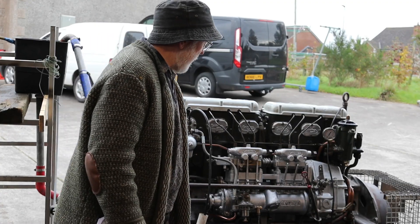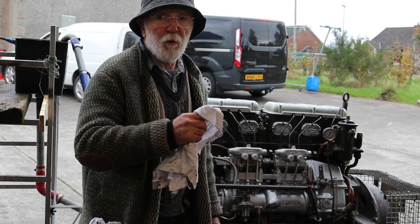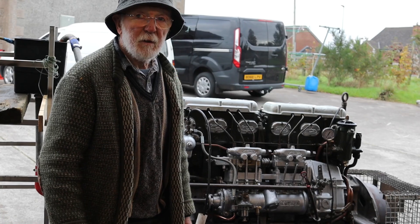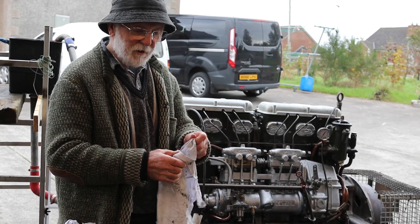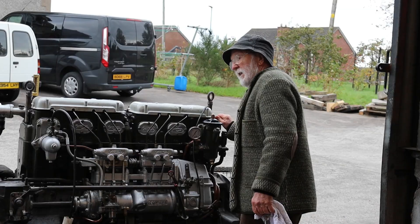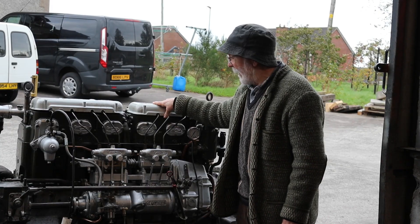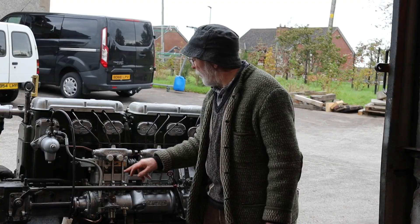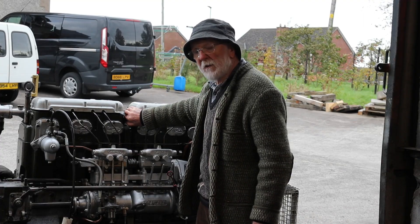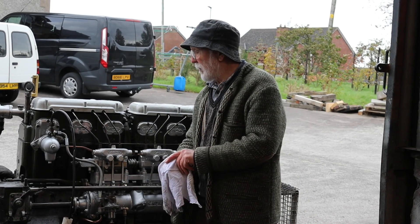So we'll go on and try cylinders 1, 2 and 4, then 1, 2 and 5, and so on until we work out all six. As a matter of interest — I should have pointed this out at the outset — if we use the decompression levers, this disables the three back cylinders, so she should then work on one. We'll see how that compares. She should run on number 1, 2, or 3, and then we can decompress the front three and she should run on 4, 5, and 6, and we'll see how they compare with the results of our first experiment.